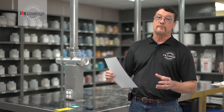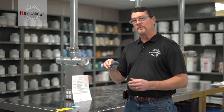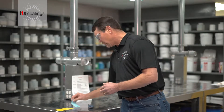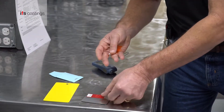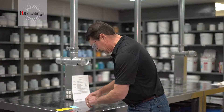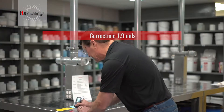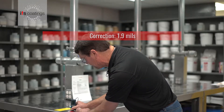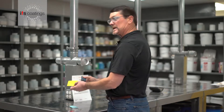The recommended film thickness for this particular product is two to three mils. Using a film thickness gauge, I always like to make sure that the unit is calibrated. So with these little shims we will check — I've already zeroed the instrument and we have 9.1, which is within the standard deviation for this piece of equipment. Now as I said, we like to be within a two to three mil window for recommended film thickness.